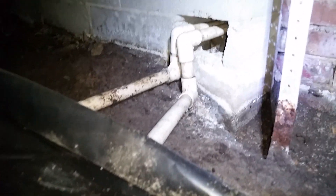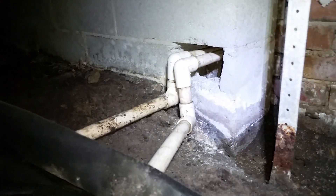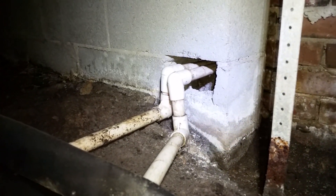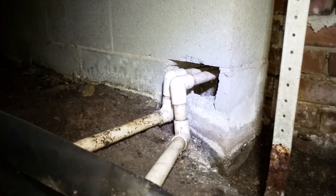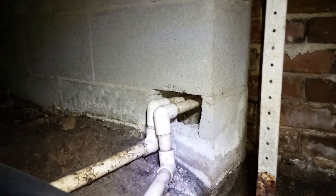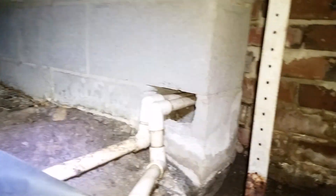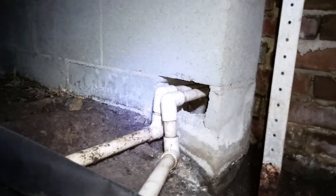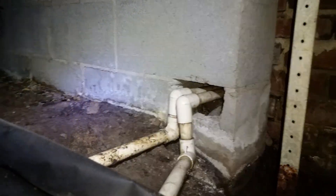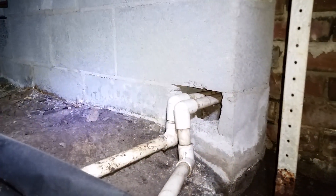It's gonna get good over here. Yeah - 90s straight up another six inches, then 90s out. So we have essentially a couple of traps in the drain. The gravity drain is draining uphill.